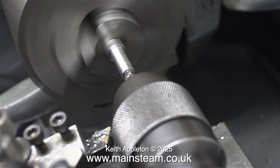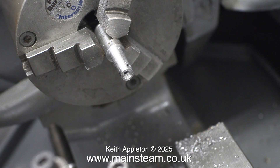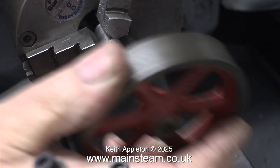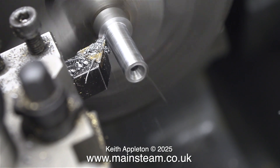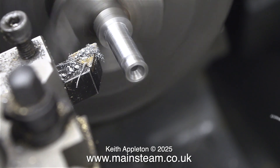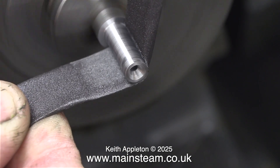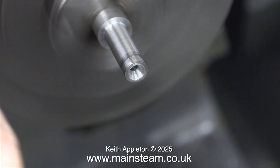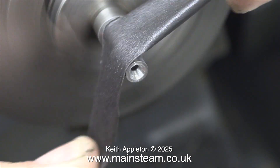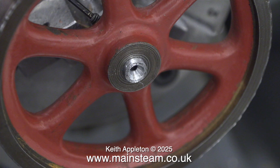It's time to drill the end using a centre drill, because what I will end up doing is fitting a live centre for when I get through the chilled area. That way I should get quite a good machine finish. This chilling doesn't go all the way through the parts — it's localised, a bit like case hardening which gives a very hard outer skin to the metal. Once you get through the chilled area you can machine as normal. I'm using wet-or-dry sandpaper to finish off the mandrel — it's still slightly tight, but after using 400 grit wet-or-dry sandpaper for the final time it is a perfect fit.